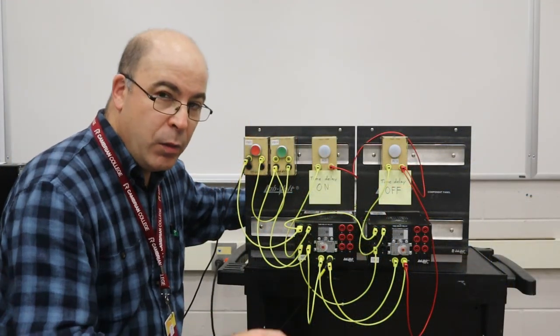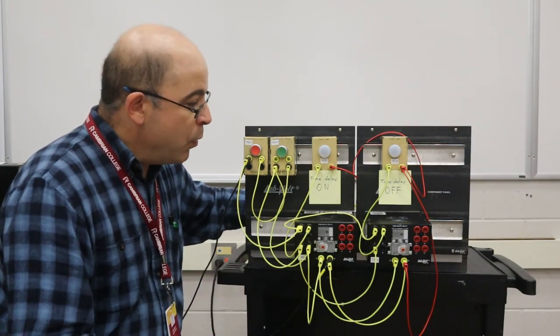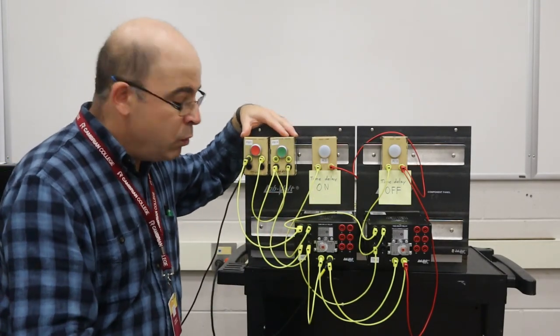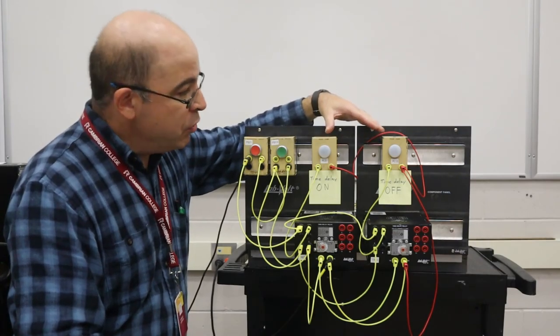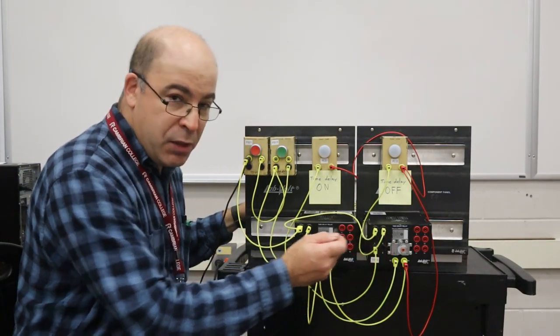Now that we've looked at the internal workings of the relay and its components, I'm going to head over to the college and set up a mock-up circuit so we can actually observe how the pneumatic relay can work between time delay on and time delay off. There are some real differences there that we need to understand. Here we have a circuit that has been mocked up to specifically demonstrate the capabilities of a time delay relay both in the time delay on and time delay off configuration. I've set up a two push button control station and each of these relays' time contacts is going to control a pilot lamp so that we can visually see the status of the time contacts for each of these respective relays.